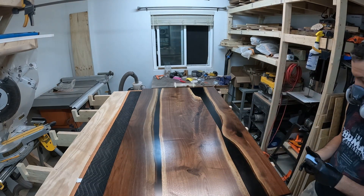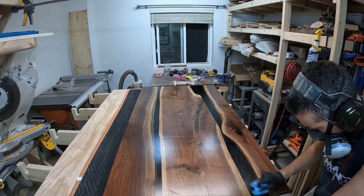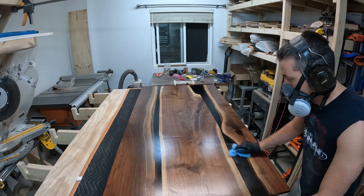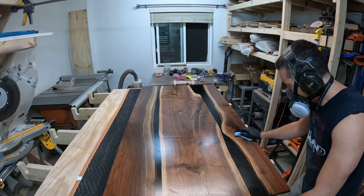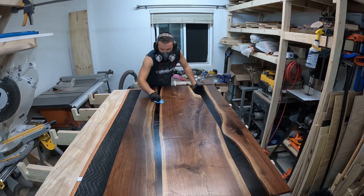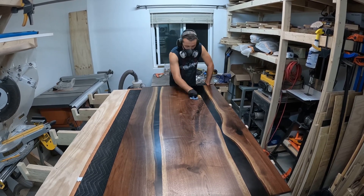After applying, wait about 15 minutes then come back and wipe away all the excess — got to make sure you get as much off as possible. On previous projects where I didn't do as good a job, the finish can come back out of the wood a little bit and crystallize, leaving a bit of roughness. It comes away pretty easily, so it's not necessarily a problem, but if this were a piece for a client you wouldn't want that because you can't fix it for them.